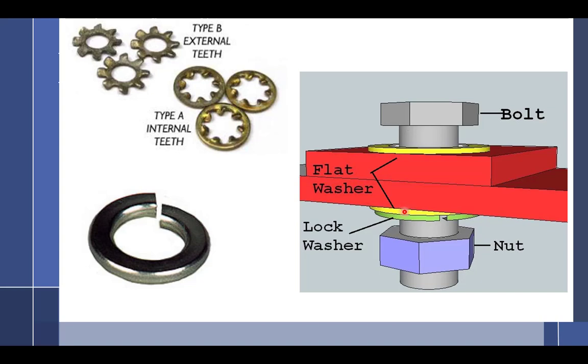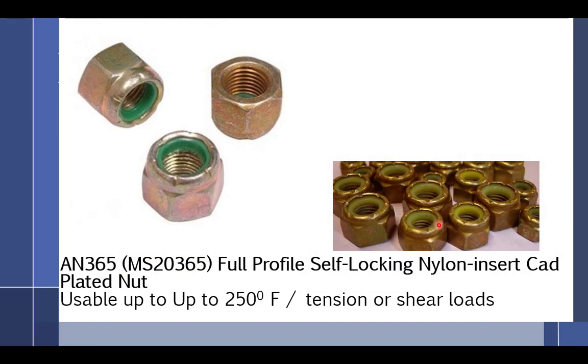Did you ever cut a bolt instead of adding more washers? Never. I would never cut a bolt. I would just get the next size down. But sometimes the next one down is too small and the next one up is a little bit too big. It's hard to make a too small one small. So you can use a couple more washers on there. Yeah, because obviously you don't want the grip showing, because then it's not going to tighten up. So what he's saying is if the grip is all the way down here, you're just going to tighten the nut up into the end of the bolt and it's still going to be loose. That's a bad thing. All right. So we're going to make sure we have some sort of lock washer.